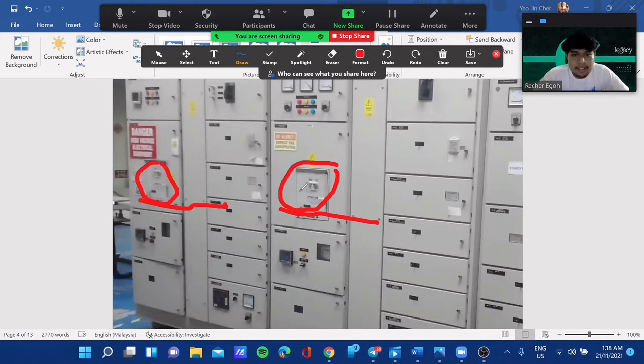If all of these are in normal conditions, turned on with supply going, voltage and current present, we can do the bus bar coupling for MSB1 and MSB2. Before that, we need to make sure that keys C1 and C2 are put in the key exchange box, and also trapped in the ACBs. To do the bus bar coupling, one of them must be turned off.